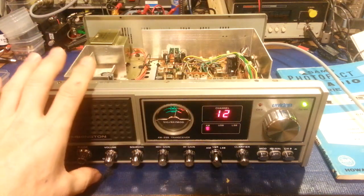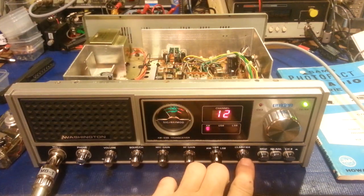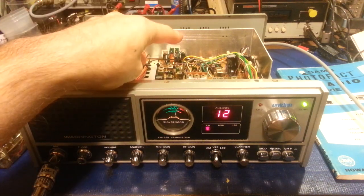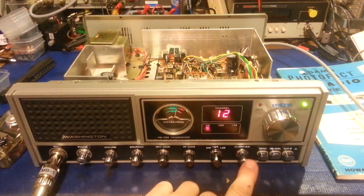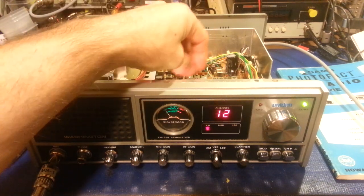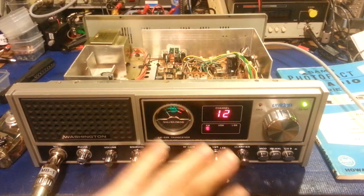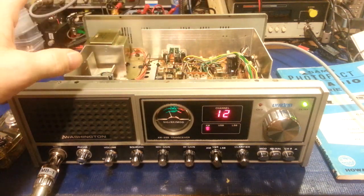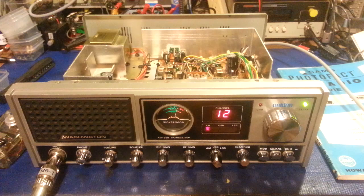When you unlock the clarifier, a factory CB radio has a locked clarifier where the receive channel is adjusted with the clarifier knob, and the transmit frequency is adjusted internally during alignment. When you turn the clarifier, you're only changing your receive frequency — your transmit frequency is hard-set with a small trimmer pot inside. When you unlock it, you're simplifying the circuit. They have two separate clarifiers: one external for receive, one internal. Unlocking eliminates that switching circuit so whatever you're receiving on is the same frequency you transmit on.